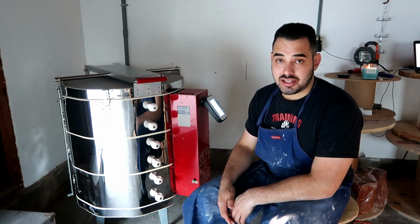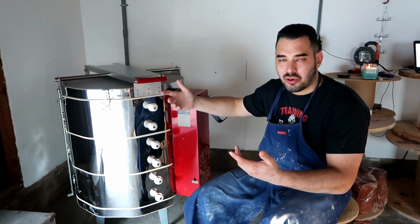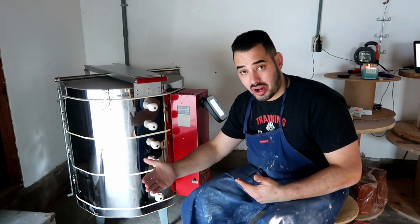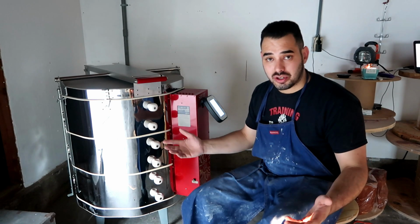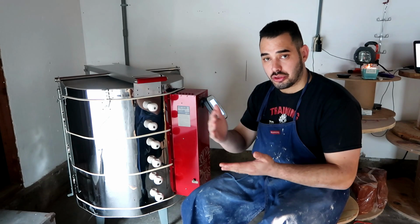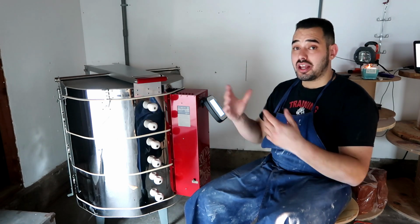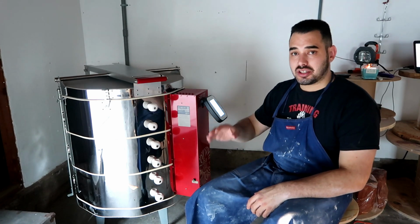It's gonna be a very sad day when you saved up about 4 G's to buy one of these babies, and then you figure out, I don't have enough power to hook up. And then you've essentially spent 4 more grand having someone come over, hook it up. You might call the electric plant that runs the power inside of your house or inside of your city to come over and make improvements to your box so it can go from 100 to 200 or 200 to 300. You don't want to do all that. I'm sure most people would rather just have a smaller kiln that takes less amps than to get a giant kiln and spend almost double the money on the kiln improving their house to take that much power.